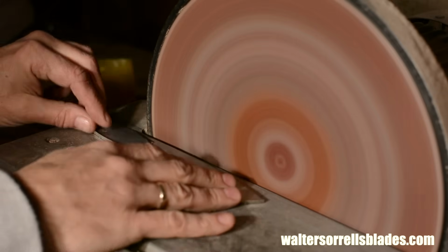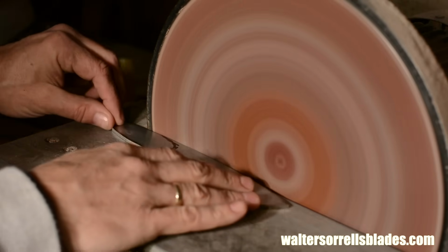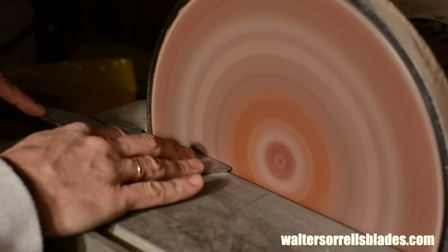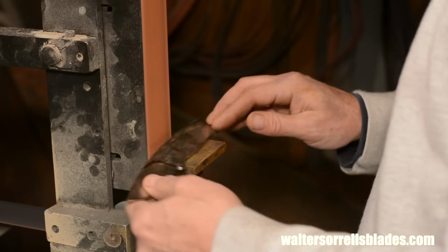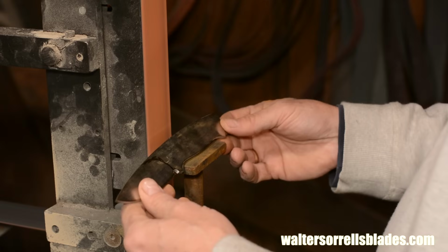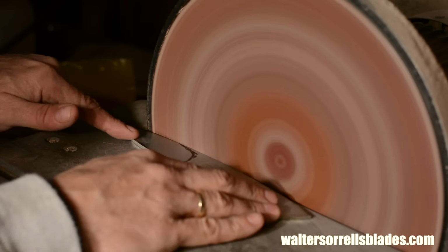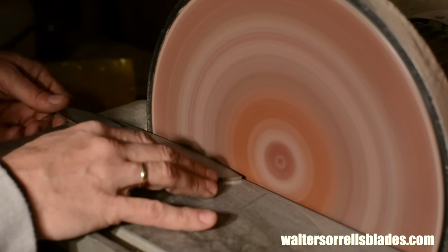I'll also use my 12-inch disc grinder to get some nice 90-degree edges. You can just as easily use the little grinding table on the Bader to get good right angles. It's really up to your taste. Once I've gotten the blank roughed out, I fiddle quite a bit to tune the design so that all the subtle angles flow well to my eye.